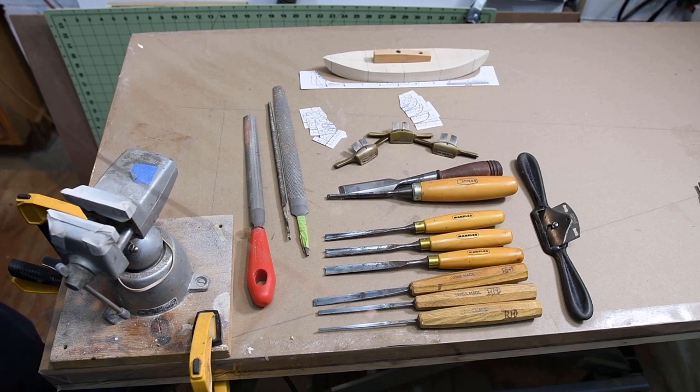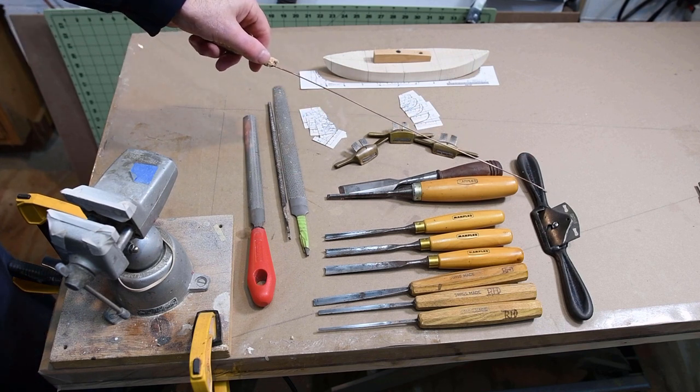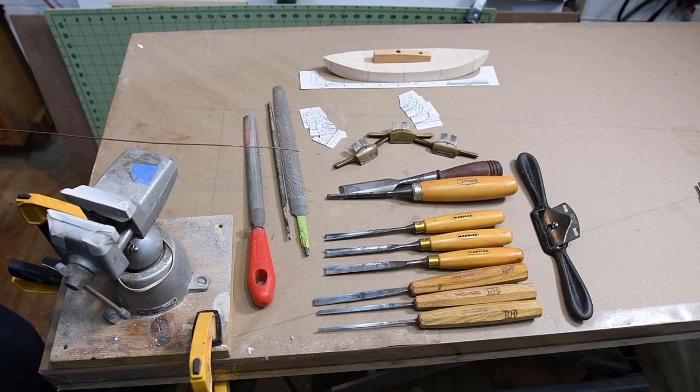To start shaping the hull, it's going to be pretty old school — all hand tools. A couple of chisels, a few gouges, some small spokeshaves, and this large spokeshave. Another thing that comes in pretty handy are files and rasps. This big one is a pattern maker's rasp — I bought this one about 15 years ago and it was about $50 then. It's not absolutely necessary, but it works very well and saves a lot of extra effort. And then I have just a couple of plain old rasps and files from the local hardware store — nothing special, just make sure they're good quality.